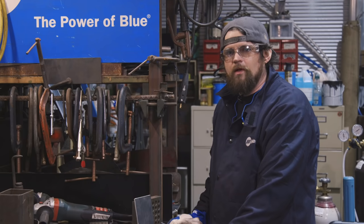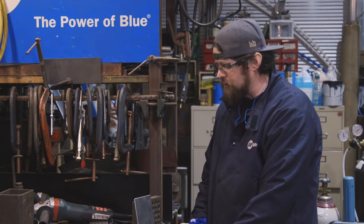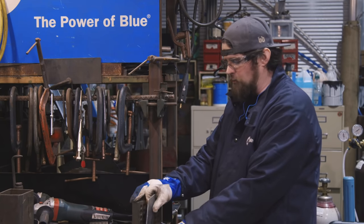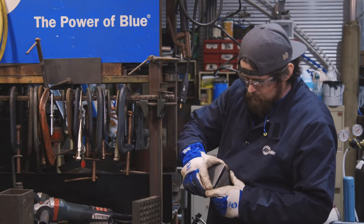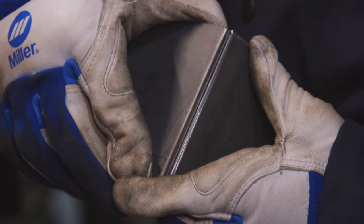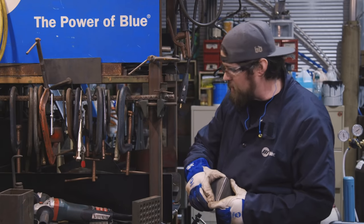Now we've prepped the sides of the materials and we've got nice clean edges for the welds. What I want to do now is set the corner height. I'm going to do a corner joint weld — you're going to have your typical corner, but I like it to overlap just a little bit to protect the backside of the weld and protect it from the atmosphere contaminating it too much.